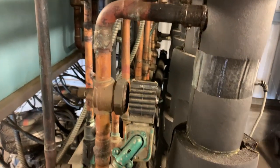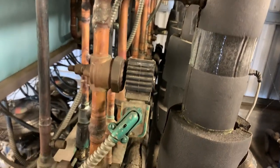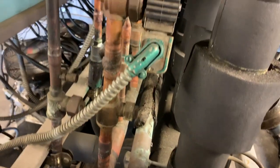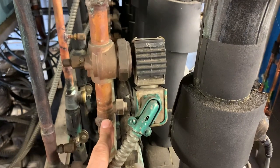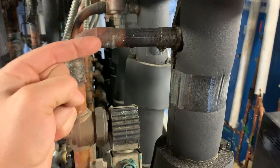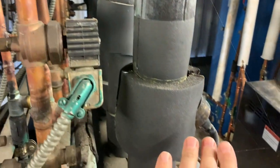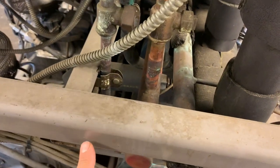So what's going to happen during defrost is you're going to shut off the suction line — to the bottom right of the screen going down to the suction header — and you're going to open this solenoid and flow gas into the suction line. That valve will be closed, and then the gas is going to come back down the liquid line. This gas is going to flow into the suction line and back down the liquid line as the rack is running, and then it's going to go up — since this valve is closed — to the coil, go through your coil, warm it up, and come back down the liquid line into the liquid header of the running rack.